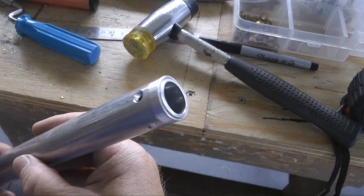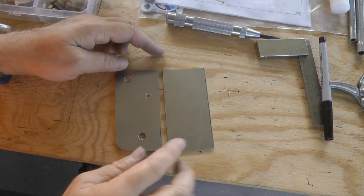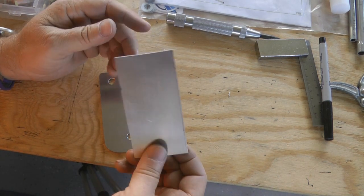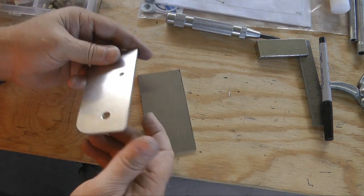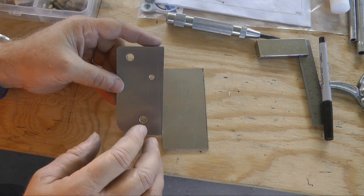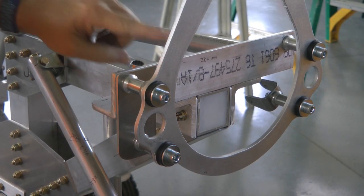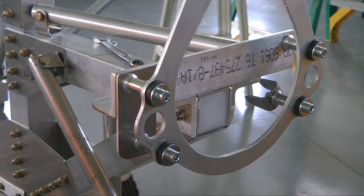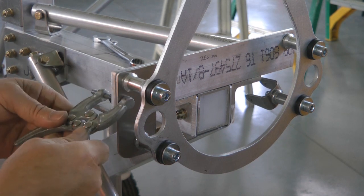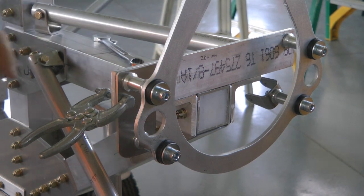Here's our completed end. Now we need two small support plates — this is after drilling and this is before drilling. Basically a two by four inch piece of 1/8" aluminum, the same material we made the gussets from. After you prepare it, you'll have three holes and a rounded corner. These dimensions can be taken from the Polini ring for the distance between the two mounting holes. To mark the third hole so we can drill into the angle iron, mount it with the ring using the two bolts to position the plate exactly correct, clamp it on tight, remove the bolts, then mark carefully that third hole and drill it.